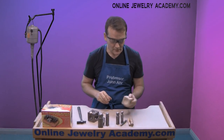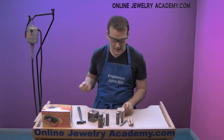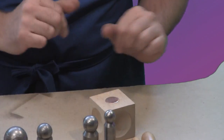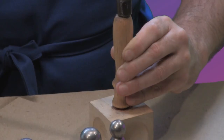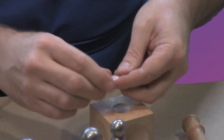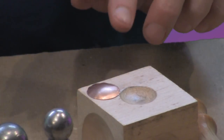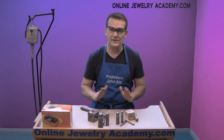The hardwood block works exactly the same way. Here I'm just going to speed up and go right to the biggest one with a disc that's of an appropriate size. If I just position my punch directly in the center, I can give it a few wraps and it quickly domes the form. Again, if you have any ripples or puckers, just go back and rework them a little bit until they disappear.